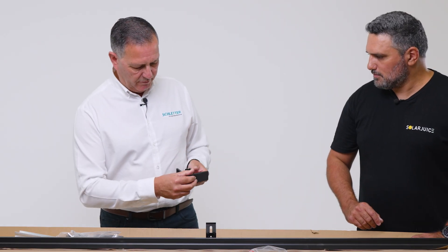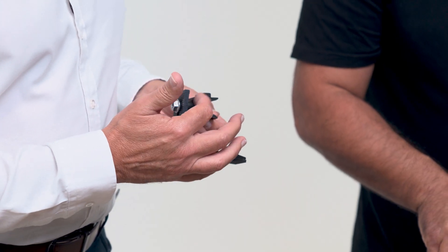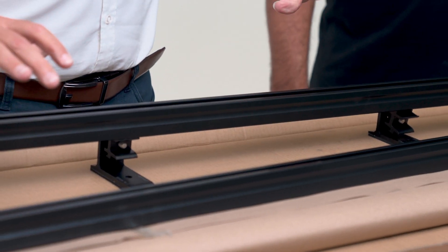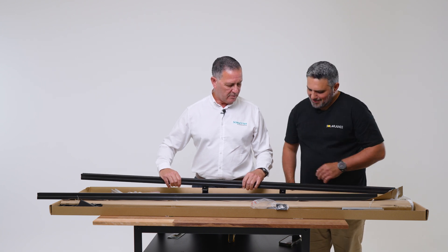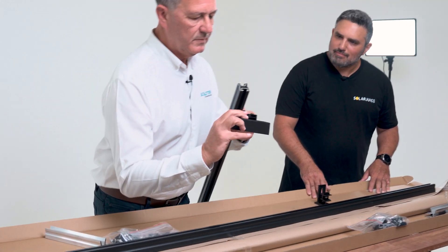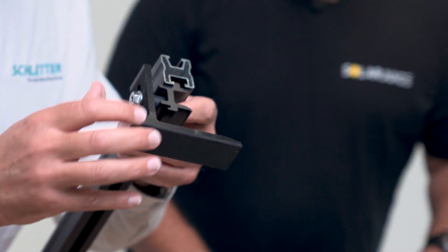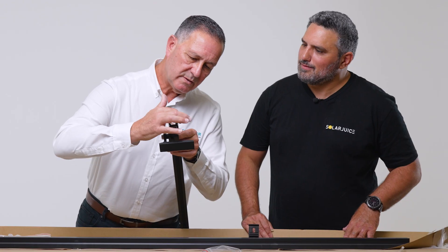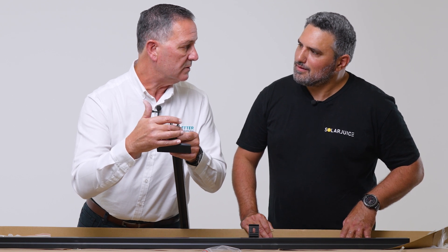What we're looking at is deploying our multi-adapter in the ProLine mode, which is a lesser distance with a bit of a ski jump here, and all we're doing is dropping in from the top and then torquing up. What the installer is simply looking for is the fitting coming into the rectangular section — as soon as that notch is grabbing, we torque up and we're done. The ski jump actually snugs in that end of the rail as well, so it stops it from going anywhere.